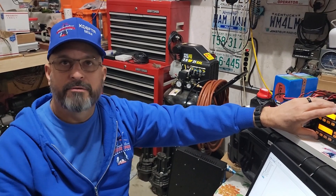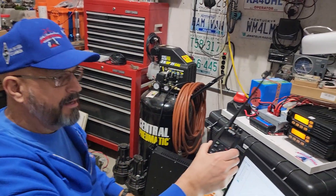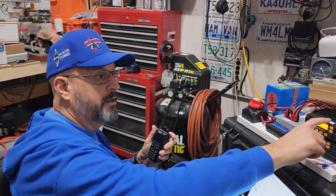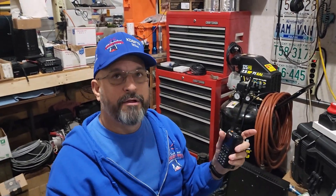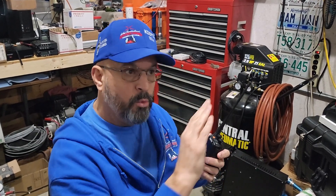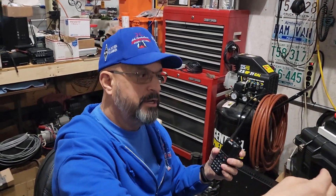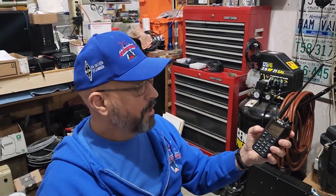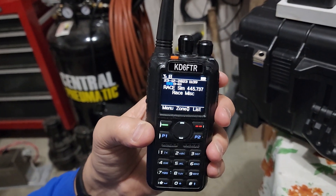That way, not just any stray key-up on one of the two-meter simplex will bring up our repeater. We wanted to kind of control that. But for the handheld end or mobile radios, two meters is our link. These radios, we're not using tone squelch because we don't need to — we're not in a busy city area. For our audience, the difference: tone is when I press push-to-talk and transmit, it sends the subaudible CTCSS tone out with whatever I'm sending. And we're using 250.3?